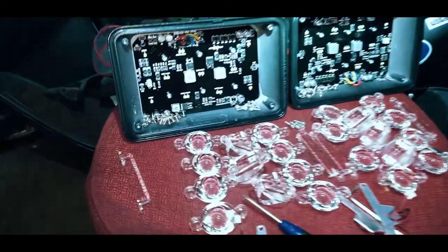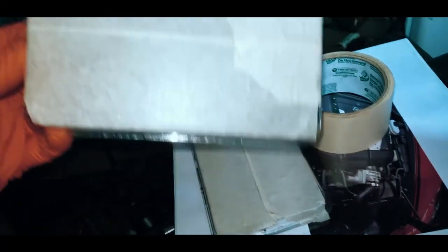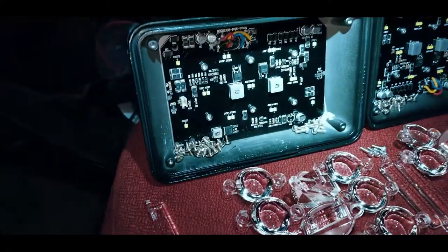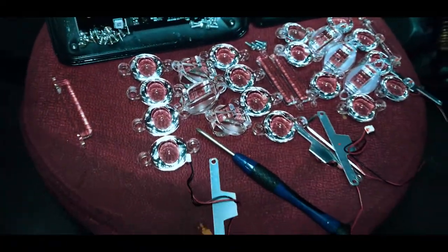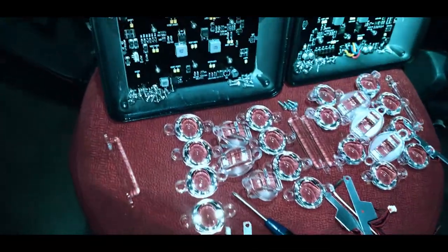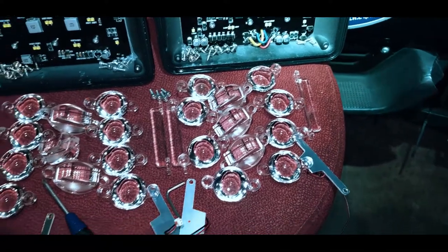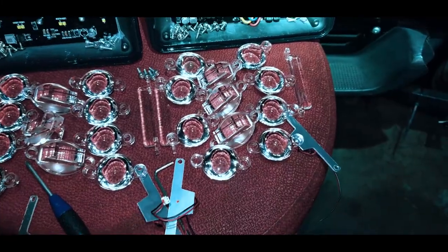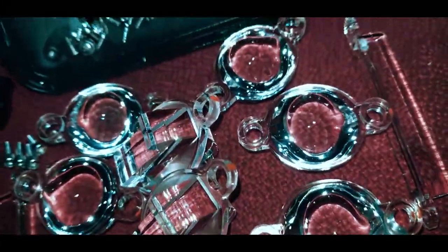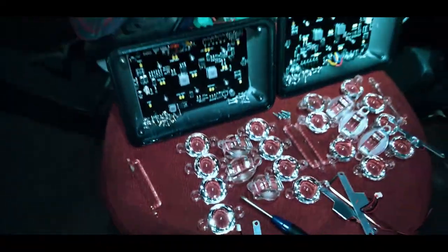I took the lenses apart. I used a heat gun and put some tape on the lens so I didn't scratch it. They actually separated pretty well — it looks like more of a rubbery gasket. There are tons of little screws holding all the lenses in. I've got them sitting in order just in case there's some orientation required. I don't think there is for the circular ones, but there definitely is for the tall ones — they're more like a light switch, so I ended up marking the edges and then marking the edge of the housings.